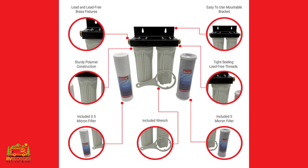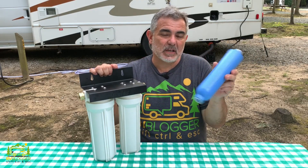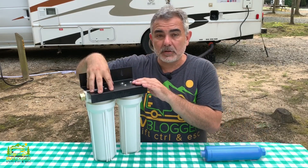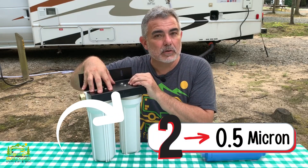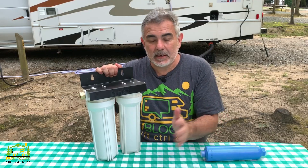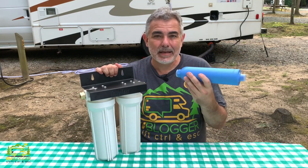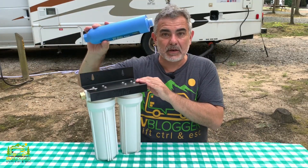The quality of these filters is what makes it so different from the blue filters you see everywhere. A typical blue filter filters anywhere from 100 down to maybe 20 microns — particles smaller than 20 microns will get through. Our two-stage filter works differently. The first stage is a 5-micron filter, really filtering out all the sediment. The second filter goes all the way down to one-half a micron, so you're getting much cleaner water with far fewer contaminants. Once I learned how these things work, I did not ever want to use one of those blue filters again — though I might use one upstream to get bigger stuff out before it even reaches this system.